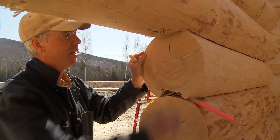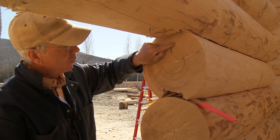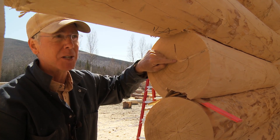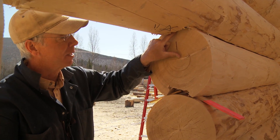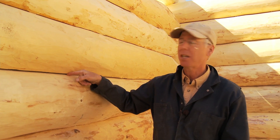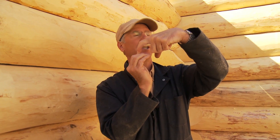If you haven't gotten to it by then, you're going to have to go deeper and deeper. There are some builders who kerf almost to the pith — the heart of each log — and so they've got a much better chance of causing the check to happen on top instead of somewhere else. An up-facing check on the outside surface is going to catch water. A check that spirals into the long groove area is going to leak air, even if there is a gasket and insulation inside. So it's best if each log cracks on top where it's totally sealed — wind and weather can't get to it, inside that gasketed, insulated cavity. The homeowners like it too because they don't see so many checks in their house.